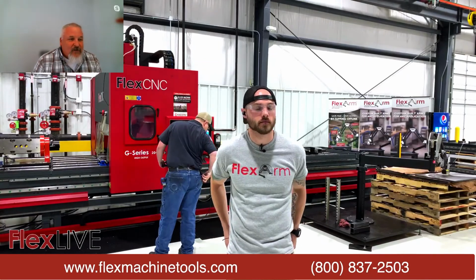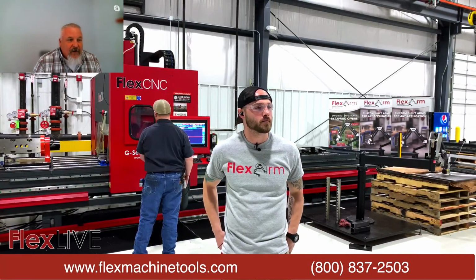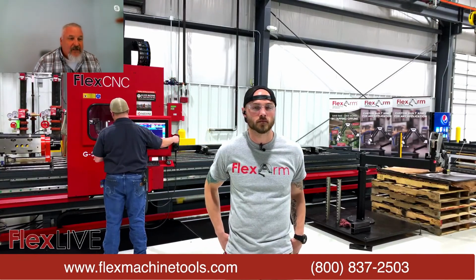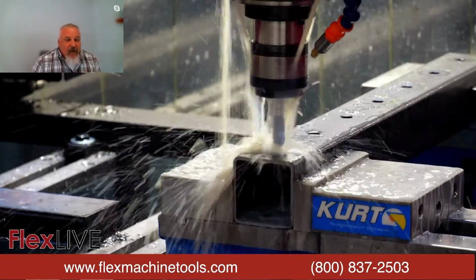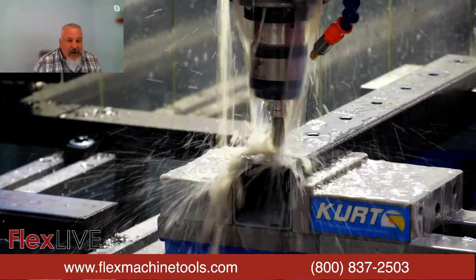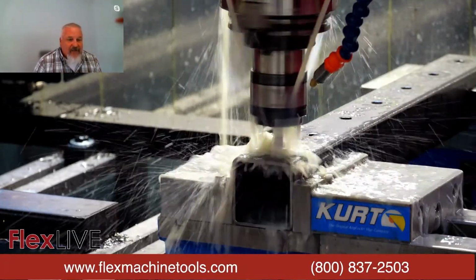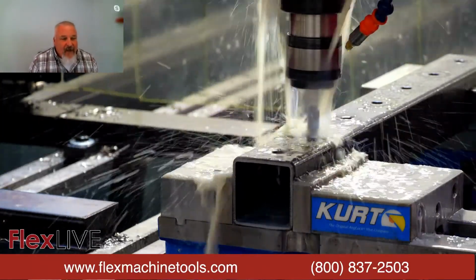As far as size-wise, we did have a large refrigeration company several years back that was trying all different sizes of NPT threads, large size holes. They make heat exchangers as well in this particular factory. And this was a 40-foot long copper tubing, had holes everywhere in it. They had a rotation of fourth axes that rotated the tube around, and we were punching anything from a 1/4-20 hole up to a 1 1/4 NPT in this particular size. So that was pretty impressive to see all those holes and all the configurations in that application.